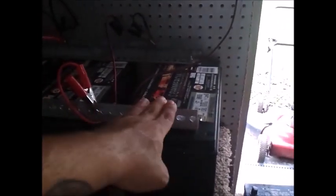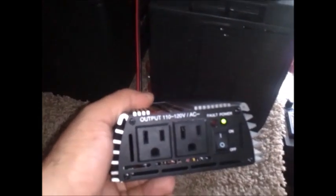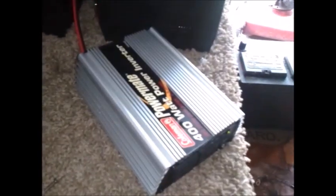All right, we got the inverter tied in. That's why I left my little experiment station here - simple clamp-on, nothing to it. Just gotta always remember this side is all positive rail, the other side is all negative rail. Got the inverter hooked up, let's cut it on and make sure it works. We've got a green light for power, no fault indication. So let's take the extension cord and plug it on up... oh, that's not good.